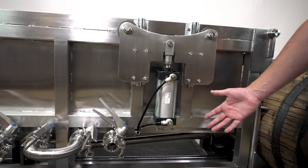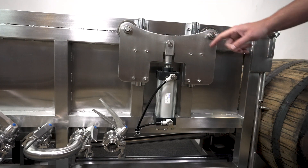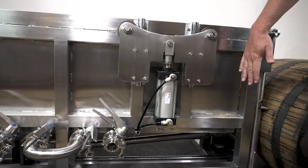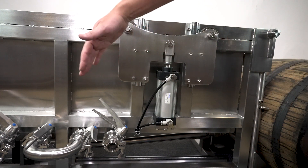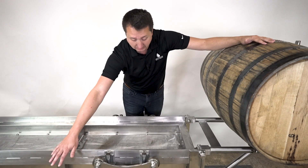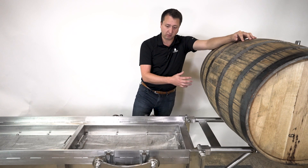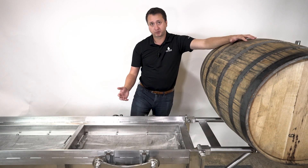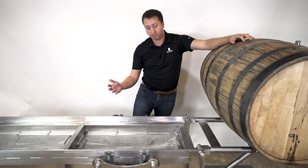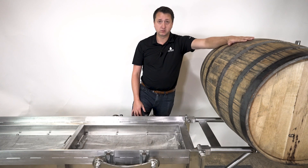Here's the pneumatic lift for the barrel roller, right here. You also have the robust lifting plate with the roller bearings to make it easy to spin. We would normally have the safety guard that comes around here that would encapsulate this so that the distiller or operator of the trough would not be interfering with this mechanism going up and down. The controls for it actually mount right here, making it a one-operator system. One operator can lift the barrel up and roll it on — it doesn't take multiple hands, somebody driving a forklift and somebody operating the trough. It makes a very user-friendly experience to dump these very heavy barrels.